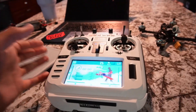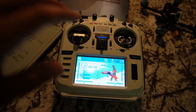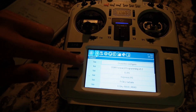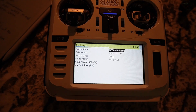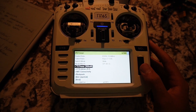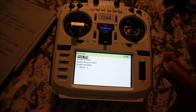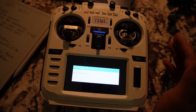This is just the home screen. I'm in my model that I use for all my drones, and the first thing we're going to do is click System. This goes for any Radiomaster controller — there's a Model on one side, System on the other. You're going to click System, and you're going to see options including Crossfire Configure and the Lua scripts. You're going to go down to where it says ExpressLRS — this goes for the Pocket, the Boxer, everything. Scroll down, ExpressLRS, and it detects my Radiomaster Ranger up top. We are going to be looking for Wi-Fi Connectivity. Click into Wi-Fi Connectivity, then Enable Wi-Fi. Not RX Wi-Fi, not backpack Wi-Fi, not VRX Wi-Fi — Enable Wi-Fi. It's going to run. Then we're going to go to our computer and look for the Wi-Fi signal that this controller is emitting. Important note: you don't need your drone on, you don't need your drone anywhere near you. You just need your controller.